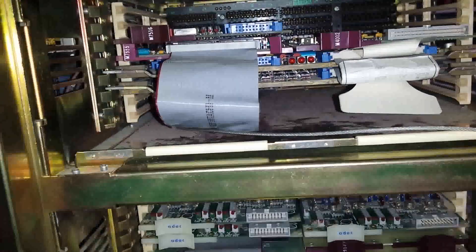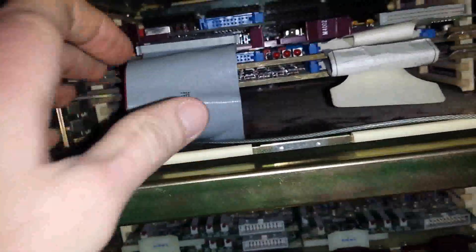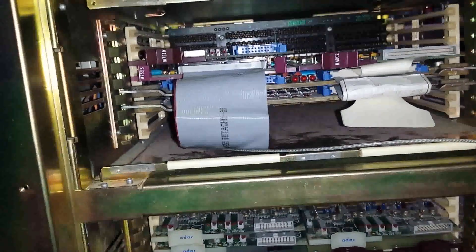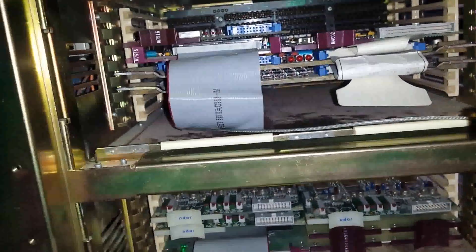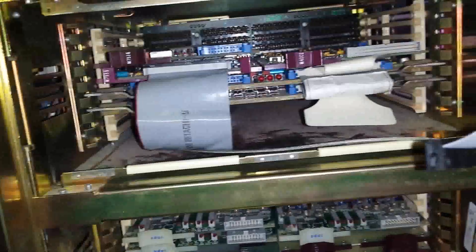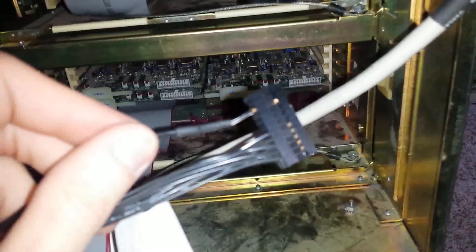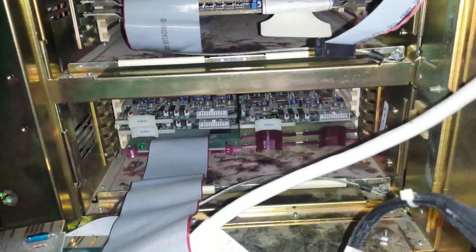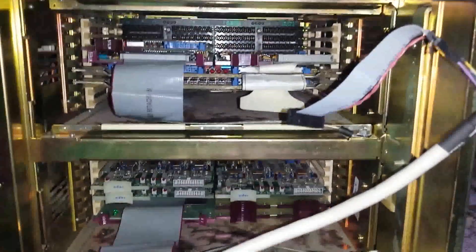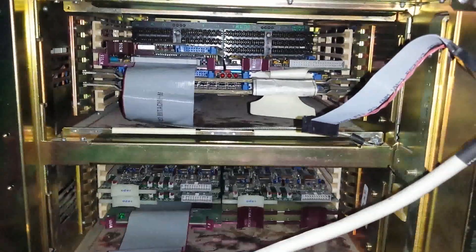Those may be the VCB-02 — I don't quite remember. But in this configuration it's a 4-bit plane graphics system. If you had another RAM card, which I don't, it would become an 8-plane system. It's capable of color, but the cabling I have here only has one coax for monochrome video. So I don't actually get color with this cabling — the monitor cable I have is only monochrome. For the moment I'm limited to monochrome, but the card itself is supposed to be capable of color. It's just a matter of cabling — someday I'll mess around with that and maybe make myself the cabling to do full-blown color graphics.